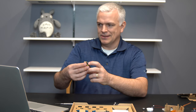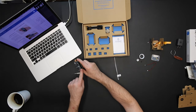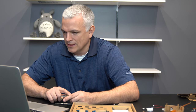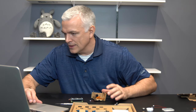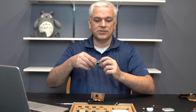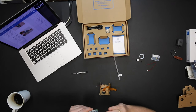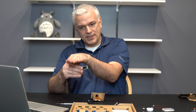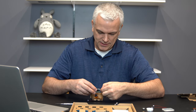Orient your boards. Okay, so here we go. Orient. Pins on the left. Solder joints, I should say. Okay, so we have a flex connector on this side. Okay, and it looks like we're gonna connect this to it. On your boards. Okay, so we're gonna connect that. So this, oh, same kind of latch. So I'm gonna push, that pushes down, and then I pull this way, because it's a rock, it's like this on the latch. So this clamps down, this is up and neutral, so we can engage the ribbon here.